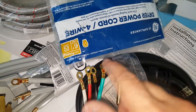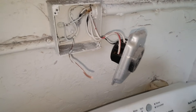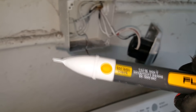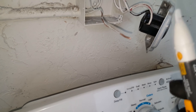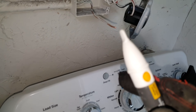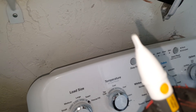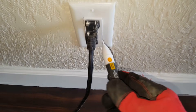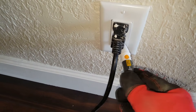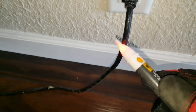We just have to remove that strap. Even though we've cut power at the fuse panel, I always wear gloves and check with my volt alert. The way it works is you put it on any line and if there's power it'll show you. I always test it on a known outlet first — I push the button and it blinked, so I know it's working. This particular one doesn't fit into the more modern outlets, but you can hold it by any plugged-in cord and see it light up.